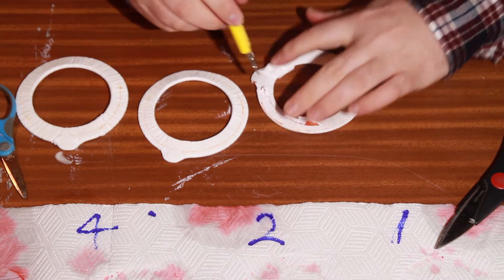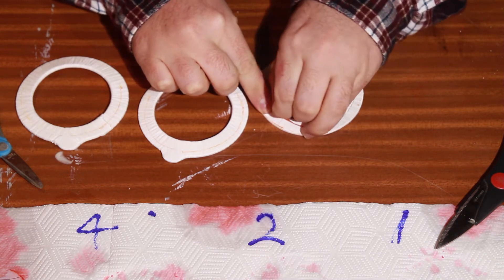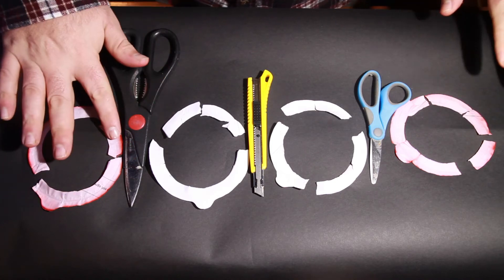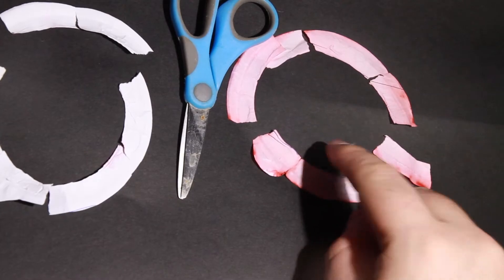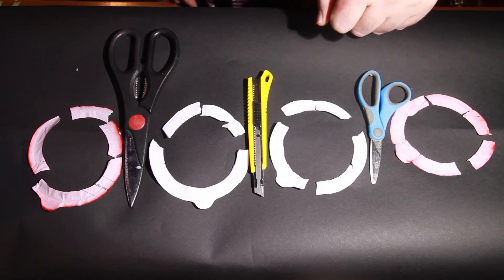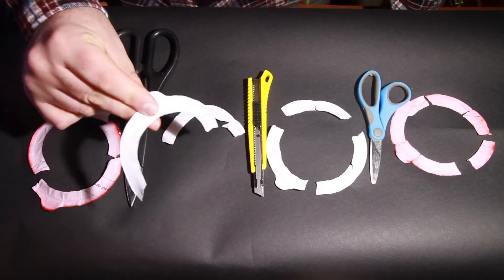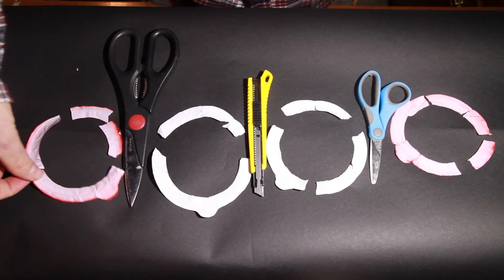Okay, so maybe this is going to be a whole lot easier than I thought. There's liquid coming out of this, so it's definitely wet on the inside. Now that it's on the black surface — the single wrapped and the control gaskets are both totally soaked. They're wet through, still damp to the touch, and red pretty much everywhere. What I am surprised at is the improvement going from one to two layers of PTFE — there's just a small wet spot, slightly red, but everything else is totally dry. The one wrapped four times is completely dry, which is really awesome. And the control worked just like I expected, which validates all the other results.